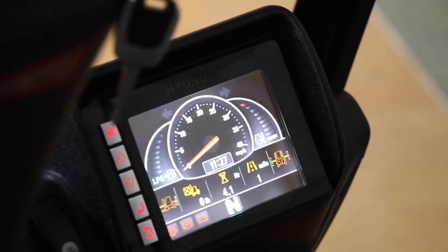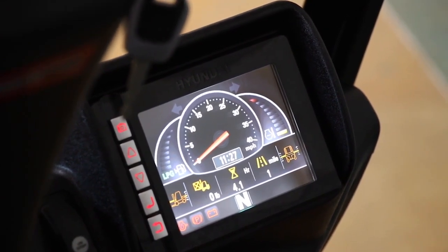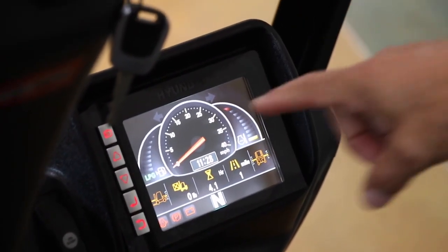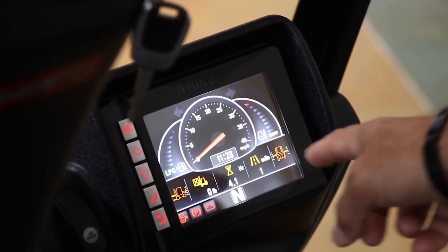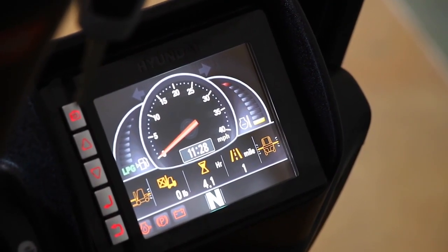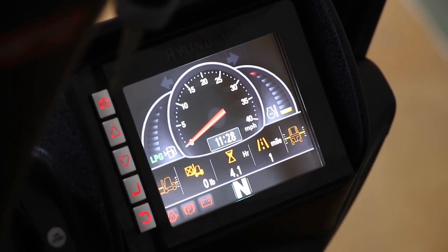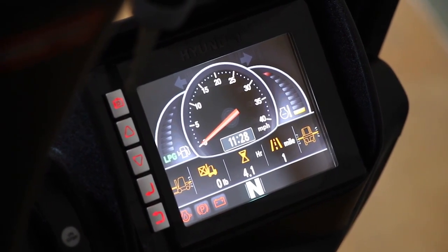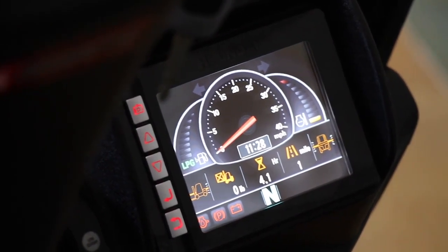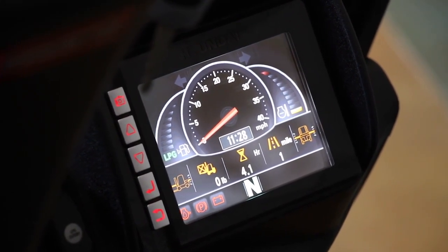First thing you're going to notice is the 5.6-inch LCD screen. That's really important because if you get the option of a backup camera, the dash display becomes your backup screen, which is really great — very similar to automotive technology. You're going to notice the speedometer, the clock, tilt inclination both forward and reverse as well as side to side, and an hour meter. But the biggest thing that differentiates this truck from the competition is the standard load weight indicator right here. That's a big deal — it keeps the operator safe, keeps them from overloading the truck, and it also lets them know what they're lifting when loading tractor trailers. The load weight indicator is not legal for trade, but it does keep the operator from overloading the truck and gives them a really good idea of what they're loading.